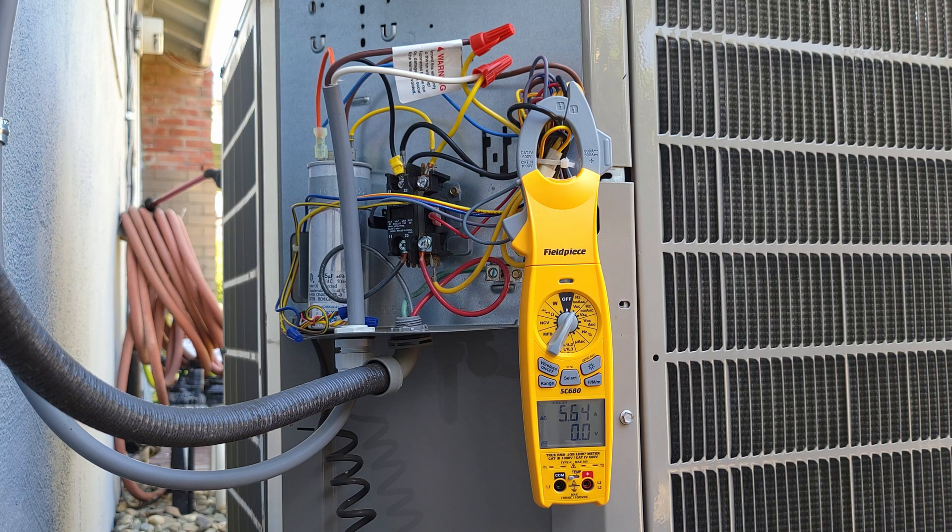The Easy Start will take about five cycles to learn the characteristics of the unit, so this number might change a little bit, but it'll still be a lot less than it was before. One thing I noticed while wiring up is that two screws were loose or not tight. So if you're in here with the power disconnected, you might as well check those screws and make sure they're tight — they probably got loose over the years from thermal cycling. Hope this helped. If you have any questions, go ahead and leave them in the comments below. I'm not an electrician, so take it for what it's worth, but I'll see what I can do. Thanks for watching.